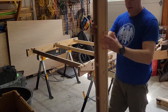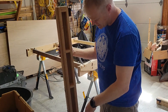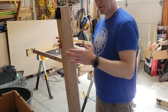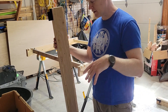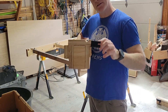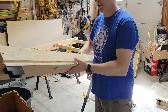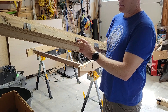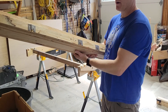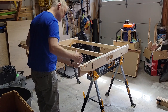This next piece is basically a box beam — three-quarter inch plywood doubled up on either end with center braces to keep everything stiff. I originally had a plain flat rail, but under heavier wood it would torque. I found online that cutting a V-groove into it keeps the wheels in line and prevents that twisting. These stiff brackets hold up the bed and also help self-square everything — there are two for each panel.